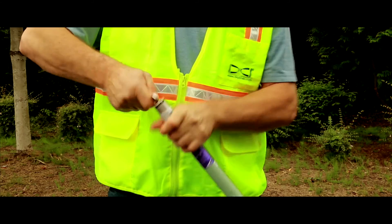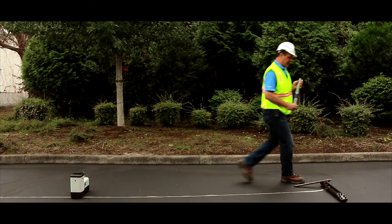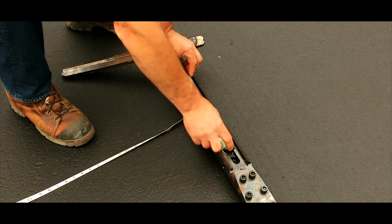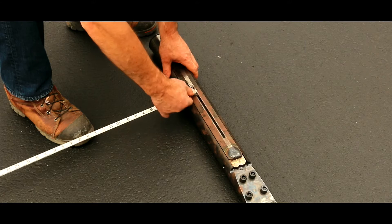I'm going to point it down and start in the down mode. I'll cinch that end cap up all the way. Now let's go put it in the transmitter housing — the drill head. We're going to put the cap on it and we're going to verify that we're exactly 120 inches from the middle of the housing to the inside edge.